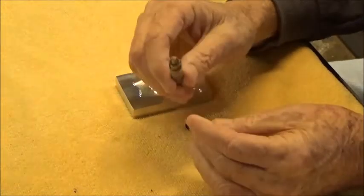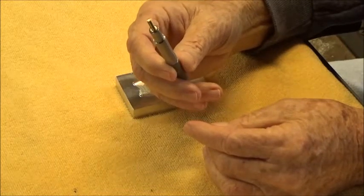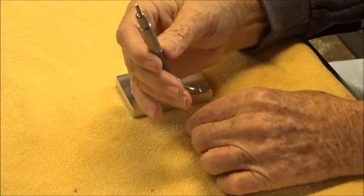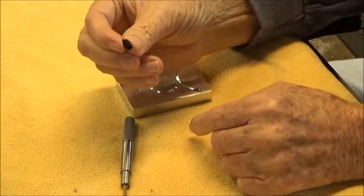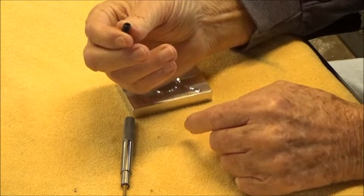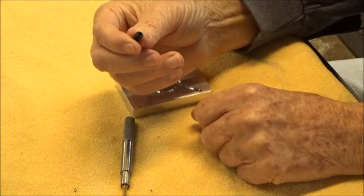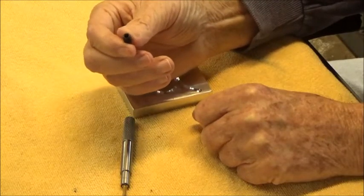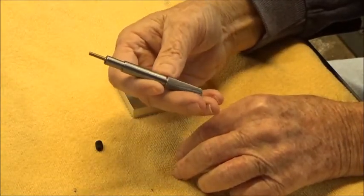The hex head is just too tight into the cap head screw, so I'm not sure what I can do about that at this point. I need to make another size, and I'm going to use a set screw instead - a quarter-inch set screw with a 1/8 inch hex drive hole. It's only a quarter of an inch, so it's going to be able to thread into a piece of 3/8 dowel.